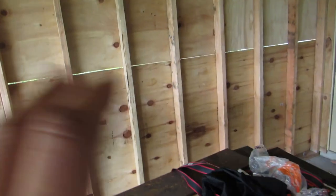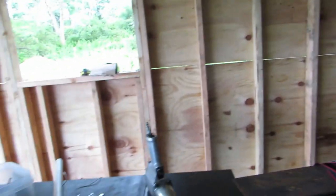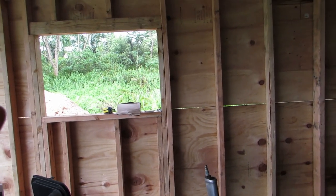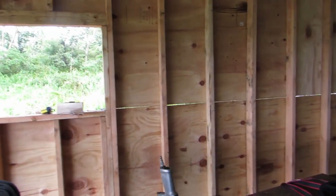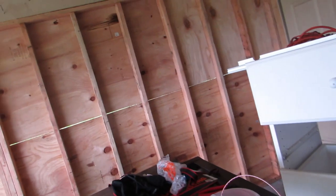I'm going to put it on all these seams. You can see where I left the gap — that's for expansion and contraction, and the way I did that is just put nails in and gapped all the joints. I'm going to do around the window and just on that seam. Maybe the top one too if I have enough. But this is actually pretty far under the eaves, and even though there's been hurricanes and everything, I haven't gotten very much water in here. Plus with the siding, I don't think it's really going to matter. Let's get to it before it starts raining.